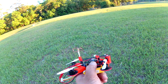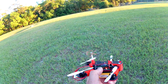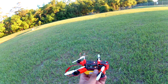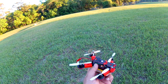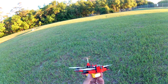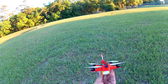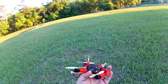On the second layer is the micro mini OSD. The third layer is the custom PDB. On the bottom you can see I use the Orange RX PPM receiver and a 200mW micro VTX. It's running on 1105 Brotherhobby 4000kV motors.